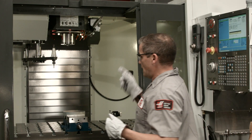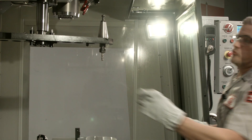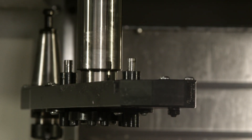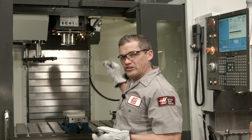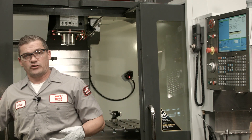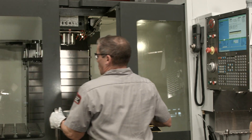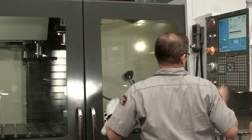I've got my gloves on — we're going to get that tool out of there. I'm going to press this plunger and then give it a firm pull. You have to remember, you can only do that by depressing that plunger. Otherwise it's going to be really difficult and you're probably going to break something. Now I need to rotate that arm so I can get access to the other tool.